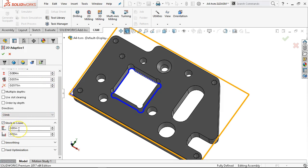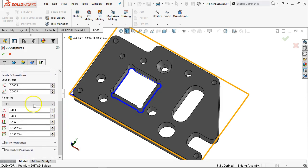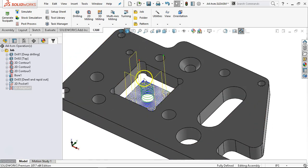We're going to go through. Maybe 10 thousandths on the wall, nothing on the floor. Then rapids, leads, lead-in, lead-out. Let's stay with 5 degrees or 50 thousandths. The clearance height I've been making 1.03. Let's see if it barks. So a couple of rapids — it's going to work its way into the corner, wrap it out, go pick up the next one, go into each of those corners and pull it out.